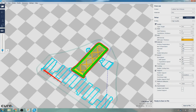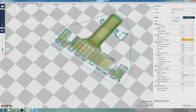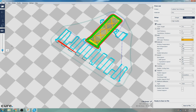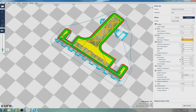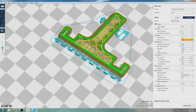So since we had this tilted back and angled slightly, the geometry apparently intersects slightly with the horizontal, so it'll print like that in 2 layers instead of 1. So I'll start with that little corner there on layer 6, and then on layer 7, I guess, it'll print in the rest of that surface, and then... Really? You're printing support for that? I guess. Yeah. You can adjust the overhang angles and stuff. But yeah, you see it's printing support for the little knobby thing that the camera sits on.